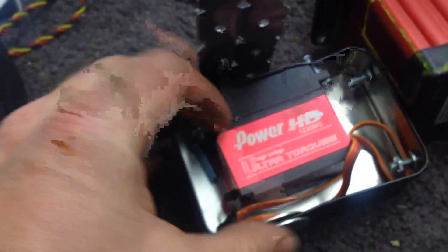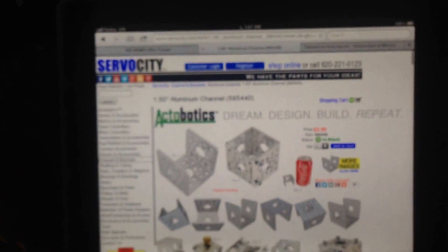That's 9 amps per servo. I need about 25 servos, but I don't expect they'll be holding full weight the whole time. Nothing is compatible with the spline size, so I'm probably going to have to go to Servo City and buy a bunch of stuff.